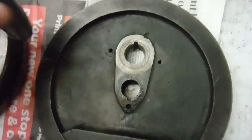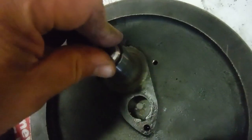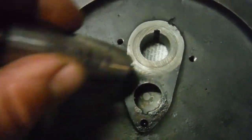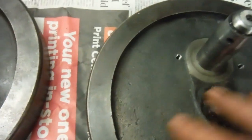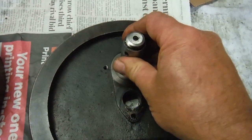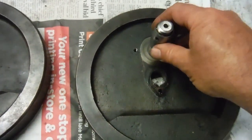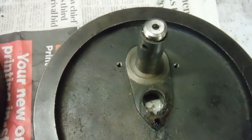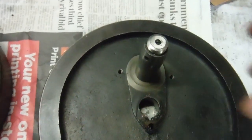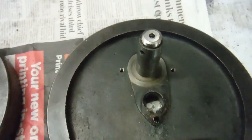Here's the old crank pin — it drops in and there's a very, very slight wobble. The new crank pin was even slightly more wobbly in both the old flywheels and the replacement ones. These flywheels are cast iron; they have no give. Steel flywheels will flex a little when you press a tapered crank pin in, but cast iron will just reach a point where it cracks — which is what happened here, either sometime before or when I was trying to fit the new crank pin.